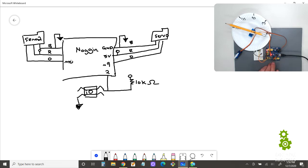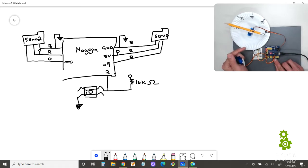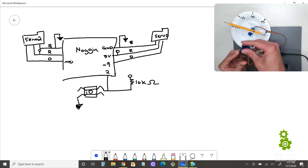So 10. All right, now the way that we connect this is we just need to put it right next to pin number 9, which is the one right over there. Now when we put it in, let's just be careful. The brown, okay, needs to match the G row. So we find column number 10, which is right here, and then brown to the G row.